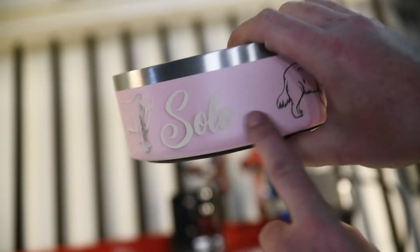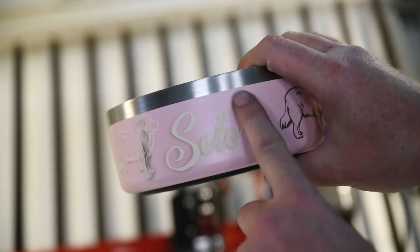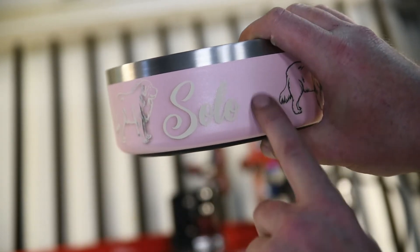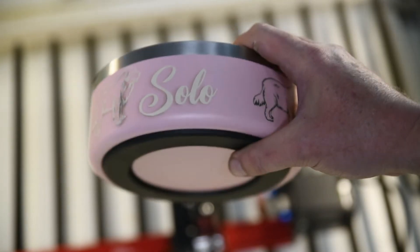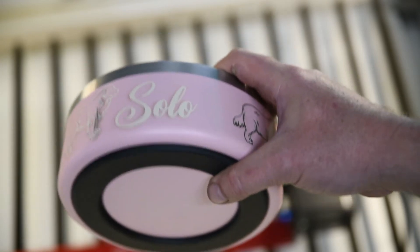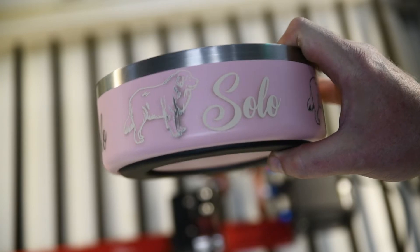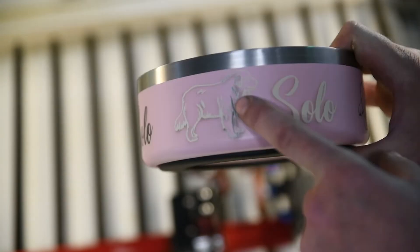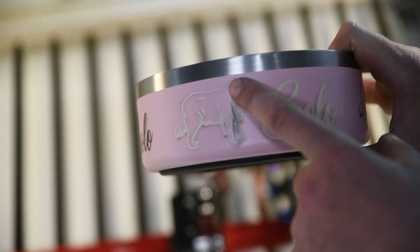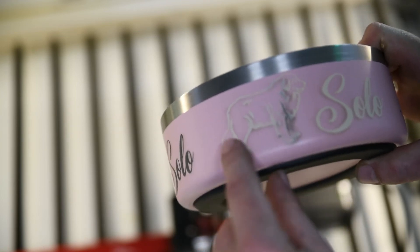And then this last one — because I was changing the powers as I went — it comes out kind of like white. It doesn't etch off the material completely, it just etches off the pink. That was 300 speed at 15 power. It's quite nice because you get a different look, but it's got a little bit of a yellowy tinge to it. When I saw it was doing that, I turned it up and changed it to 600 speed with 20 power, and it still works like that.